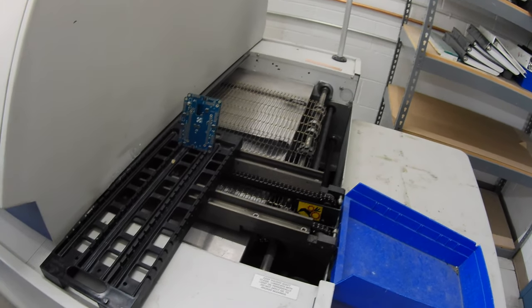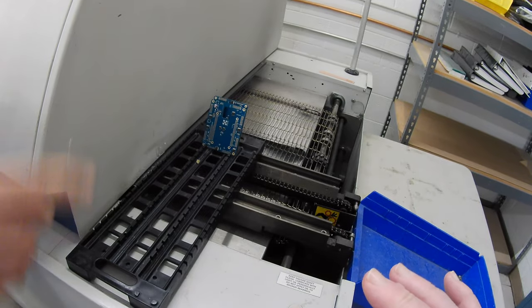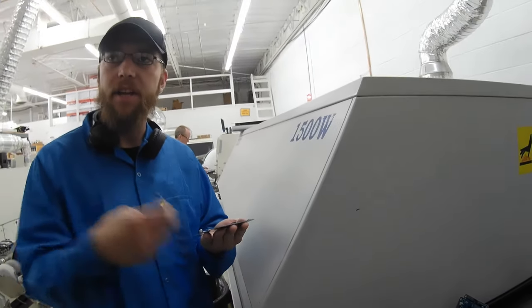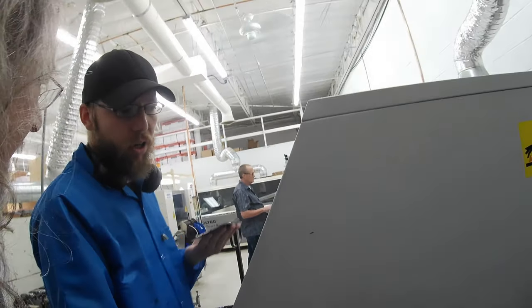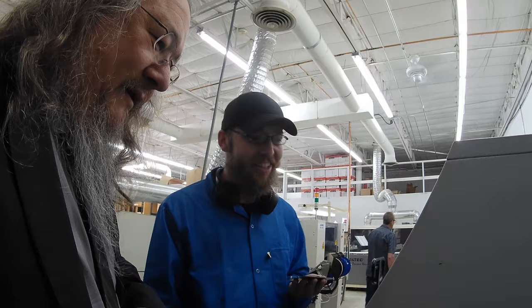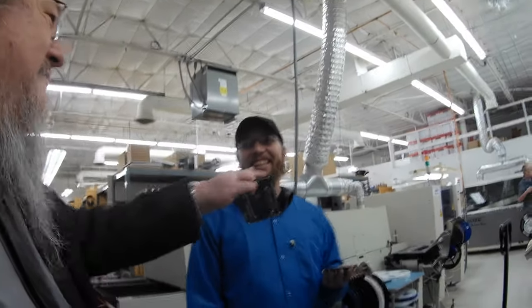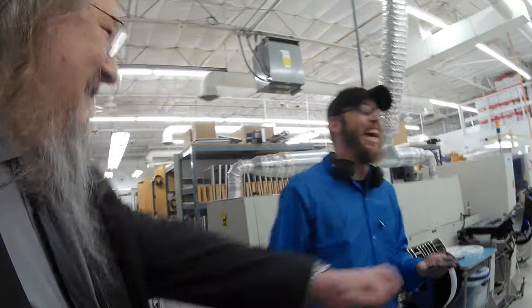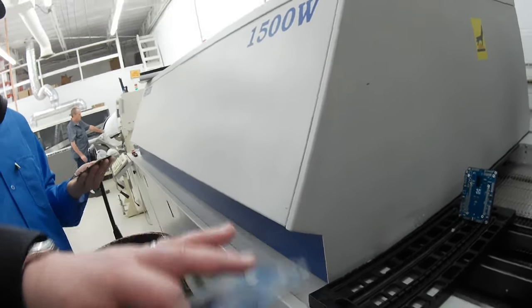That's very cool. And we're still debating it, but I might be removing the bridges in this portion too. You mean just taking a look at them? I'll possibly set up a lead free station for them and just get out the solder bridges. Because that's something that you're going to see with some frequency? I'm hoping not. But you never know how tight you're set up. Yeah, the calibration on that screen thing is pretty spot on, so chances are we won't have to. When I was hand screening these things, I've got a hand screener over there. Well, he showed us last time. Even that is miles better than what I was doing with Kapton tape on the kitchen table. So the point is, you're going to check these, just looking for bridges. Absolutely, and touch them up before they get the flux washed off and so on.